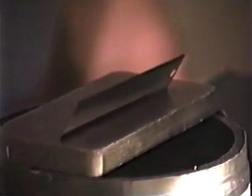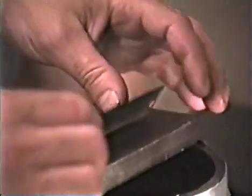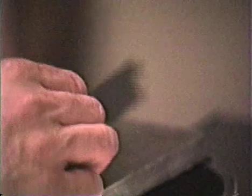This one is at 60 hertz. Now you go up with this one, right? That's good right there. If you go off just a little bit to the edge, see? Yeah, there we go. Now we gotta bring this one up with the magnet in resonance at its 12 and a half hertz resonance. There you go. Now bring this up to the stop. Then we bring up the trigger circuit at 60 hertz, which is being applied to the large coil.